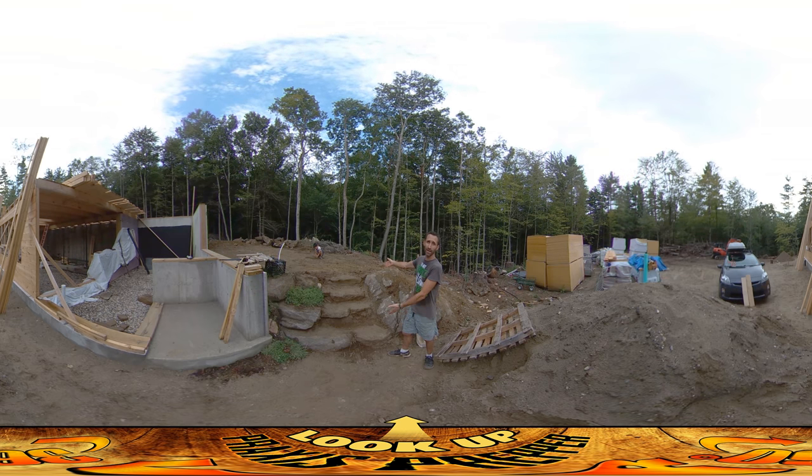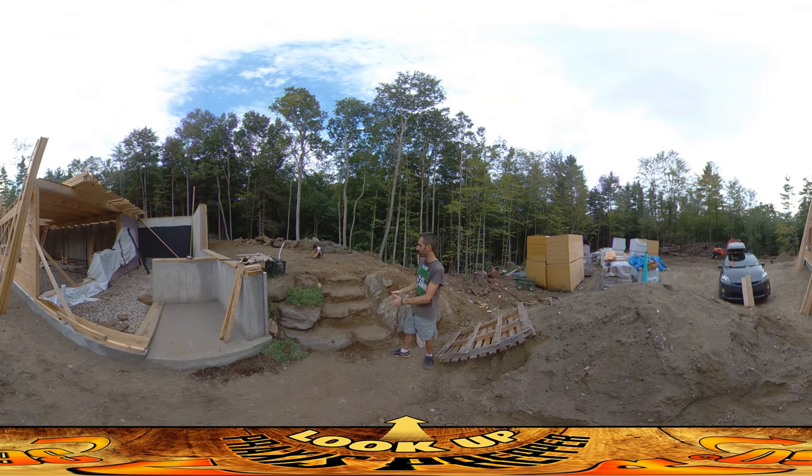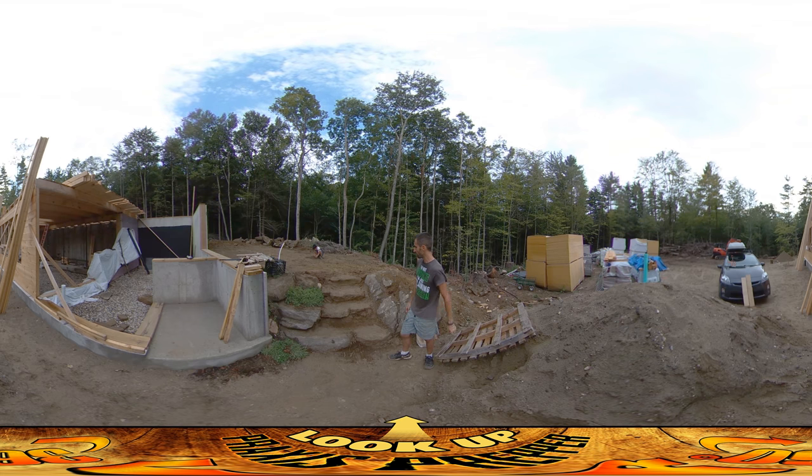Voila! I love doing stone work with this kind of stuff. But behind each stone is a lot of sand and gravel, so you get good drainage — you're not going to get frost heaves behind them. They might frost heave a little bit, but overall, good drainage behind it and big stones really deeply set into the earth, so these should stay pretty solid.